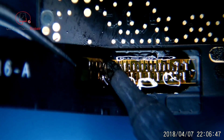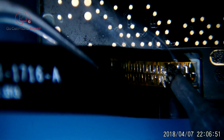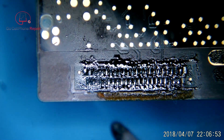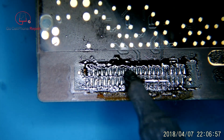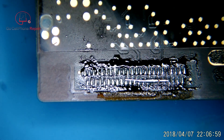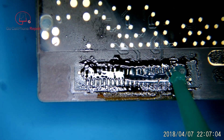What I'm doing is gently lifting and going back and forth with a big glob of solder on my iron, and you'll kind of get a feel for it. You can see that adhesive down there at the bottom. We'll just flow these out real quick while the board is nice and warm, and then we're going to clean this up, get all that adhesive off, and get these tinned and ready to install the new one.